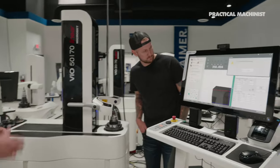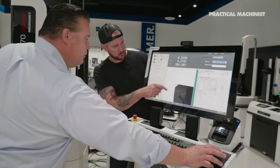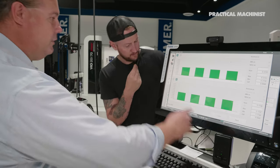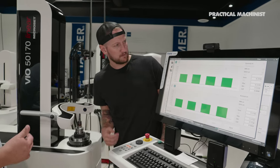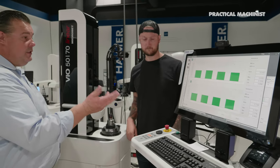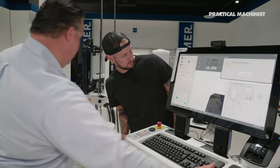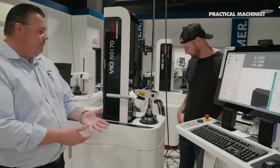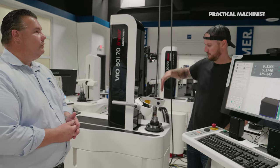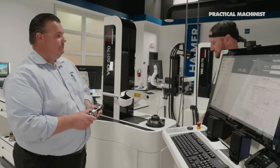When we're done you can pull up a graph showing whether all cutting edges are in tolerance. It's measured all four now — you can see all four cutting edges are within tolerance for both X and Z. If they were bad they'd show in red. If this were an inserted tool with four inserts and insert two looked strange, I could select it and automatically bring that cutting edge around for the operator to index it, open up that pocket, and inspect it. It knows which is insert one, two, three, and four. Unclamp, go to the next tool — good to go.